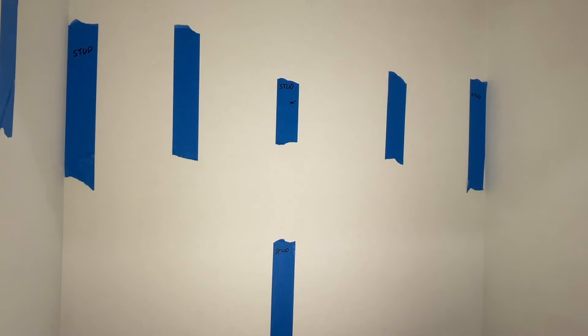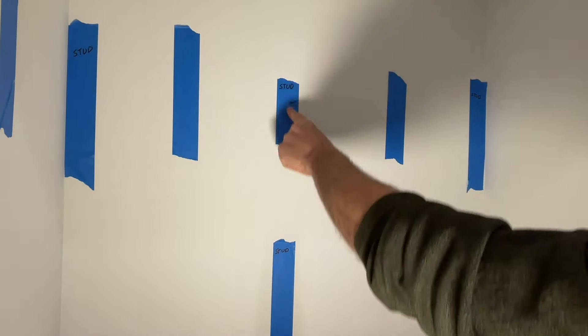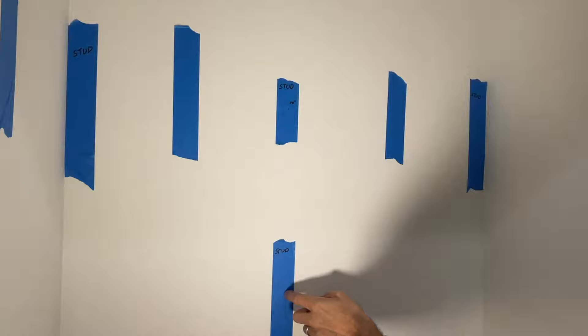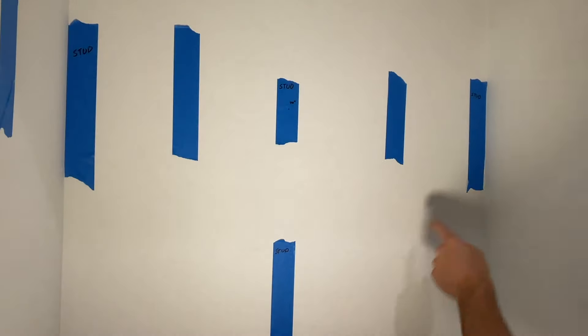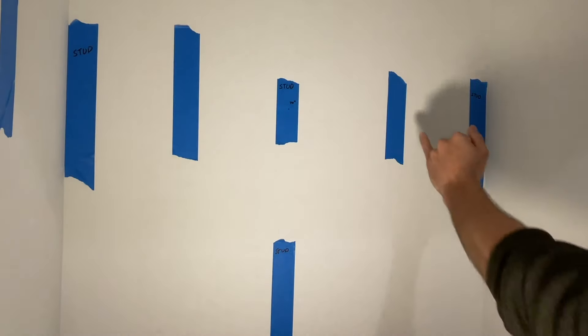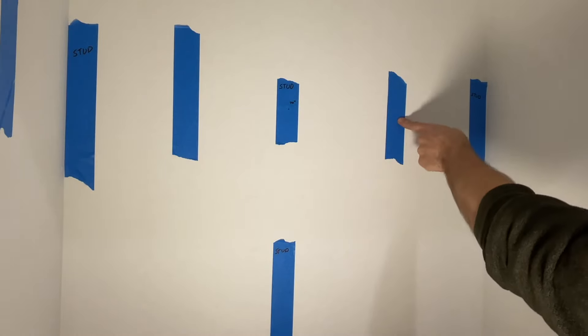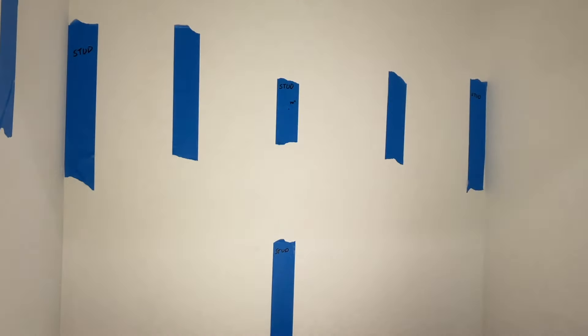Now we have our shelf cut and we're back in the closet. I prefer mounting to studs, so I have a stud here that I've marked where I'm going to mount the clip for the top shelf and also where I'll use a supporting bracket in the middle. I also have studs in the corners. I'm going to demonstrate how to do a toggle bolt for a wall cavity, and also show the standard clip with the nail and wall anchor — so two different methods for two different wall cavities.